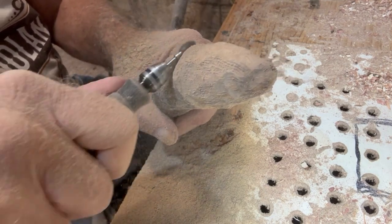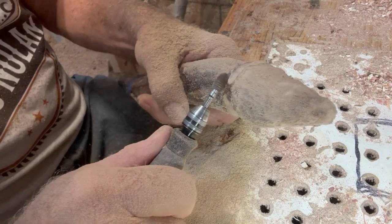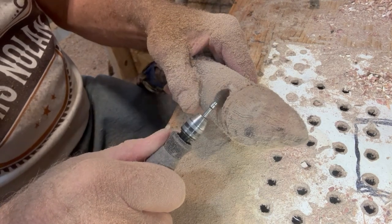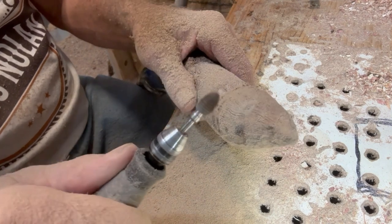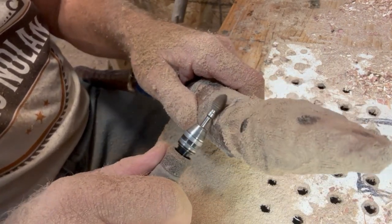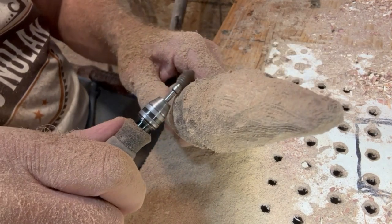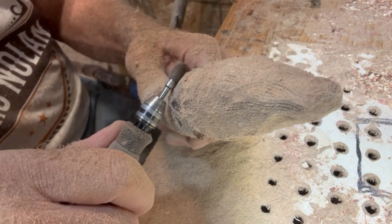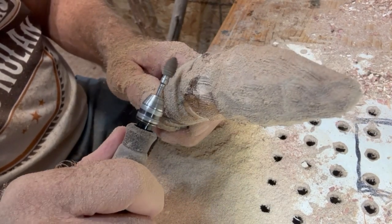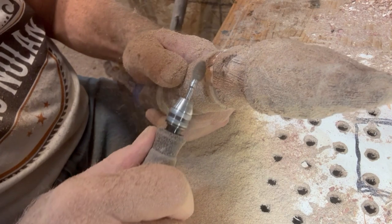Today's mushrooms are fairly easy to do — just get your cone started and then kind of round it so you don't have any flat spots on that cone, and you're basically there. We want to do the bulk of this shaping before we start doing the decorations on the top. Morels can have a long skinny base that you don't want on a walking stick, or they can have a fairly short base in the wild. We have some nice size morels in Missouri — over the Midwest actually. I was born and raised in Indiana, and that's morel country over there too.